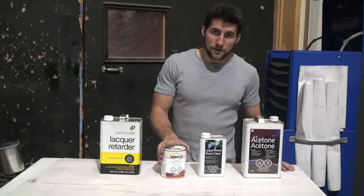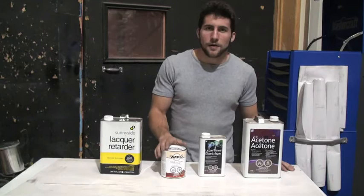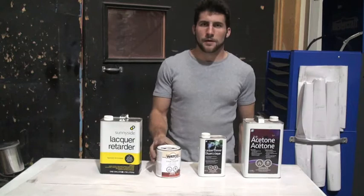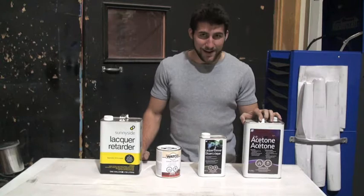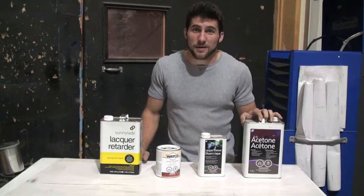What I'm going to do today is show you how I mix that in order to have it be sprayable, and then I'll give a quick demonstration of spraying it onto a random piece of wood. Let me first talk about what the components are. Obviously you need your lacquer. Then, in order to thin it down to a consistency where it's more like a spraying lacquer, I'm going to use acetone. Be careful with this stuff — it's pretty strong and does not make you feel good if you breathe in a bunch of it. You're going to want to wear a respirator when you spray this.